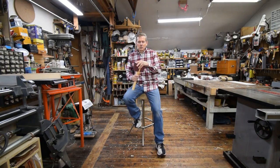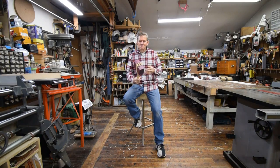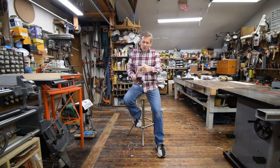I make these videos to share with you the projects and the woodworking techniques from here in my shop. Today's project, a wooden assembly mallet. Seems simple enough to start with. Purple heart head, ash handle. These are often referred to as a mystery mallet. They're assembled with two dovetails and a center through tenon.